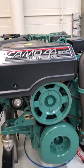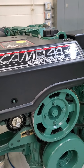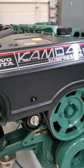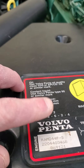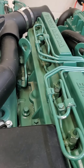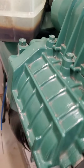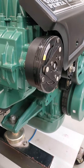Here's the engine — this is a 44 EDC engine. KAMD stands for compressor after-cooled marine diesel engine, while TAMD would be turbocharged after-cooled marine diesel engine. This engine is a six-cylinder engine. It has tags on it for both 3.3 liters and 4 liters, so the 32 series would be similar except four-cylinder. This is still a mechanical injection system — it just has an EDC processor on it. It has a belt-driven compressor and an electromagnetic clutch, just like the air conditioner in a car.